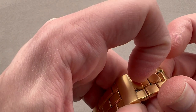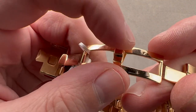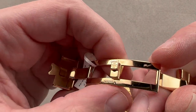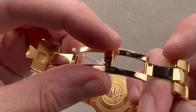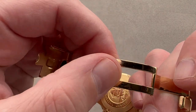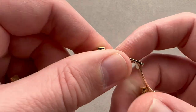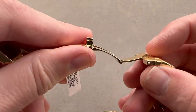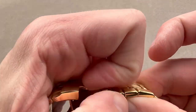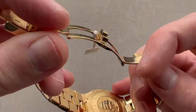There is a little Maltese cross motif on the clamshell that locks this bracelet. You can also see a back-and-forth lock that is the second locking factor — a little slider for this double-deployant clasp. So you actually have two locking factors: the slider and the clamshell, and both have little Maltese crosses on them. Ceramic spring-loaded pin snaps were employed to make sure that, over time, the tolerance of the clamshell remains snappy, as the gold cannot wear down the ceramic.